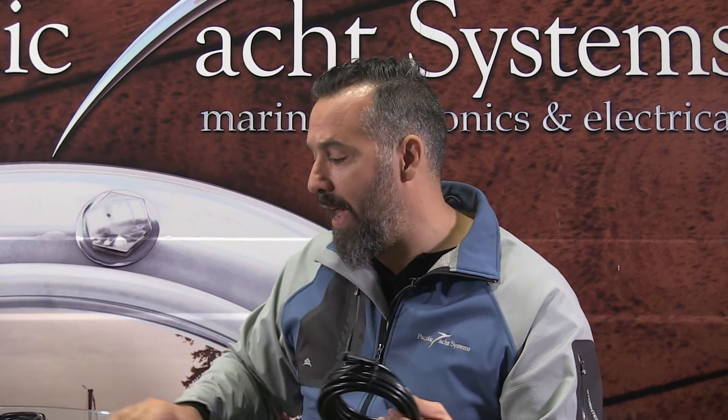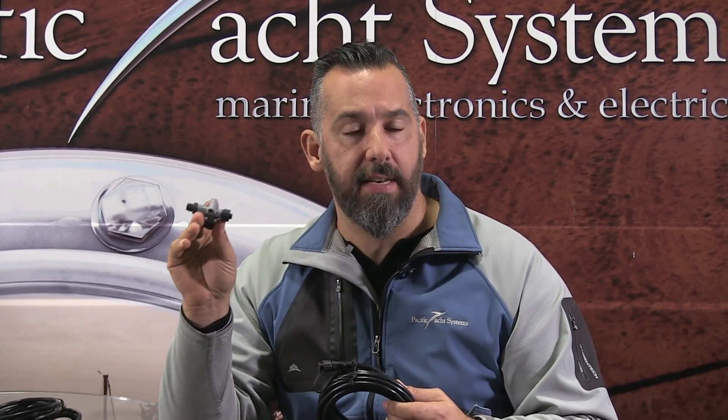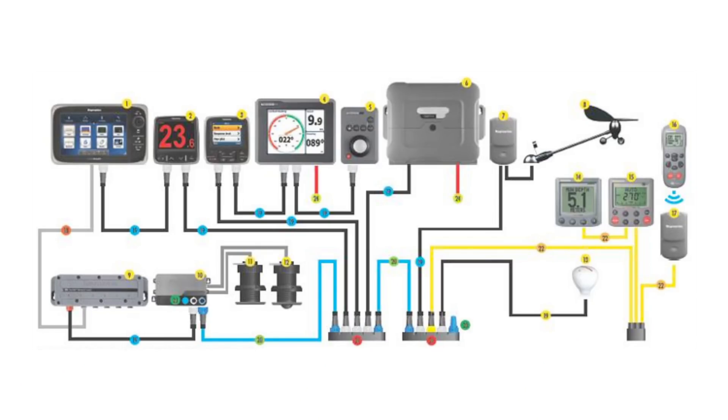Don't build your network just for today — think about the future. When we're actually routing a cable from the engine room, through the salon, and going directly to a flybridge, I'm going to install a cable with two different cable lengths and prepare for a splice, meaning I'll have a place where I'm anticipating one day connecting another T at the lower helm. Don't just do what you think you need today, but look forward, because the beauty of NMEA 2000 is that you can interconnect multitudes of devices on this backbone. You don't have to run cables from all these different endpoints back to a single point — it's not hub and spoke, it's a bus topology. And that's really nice.